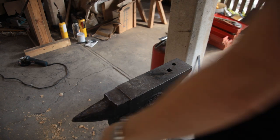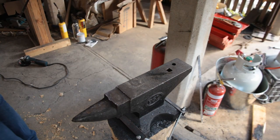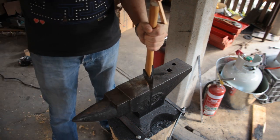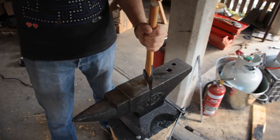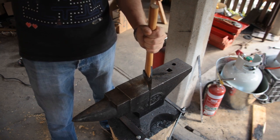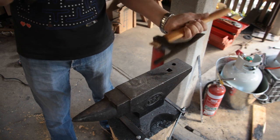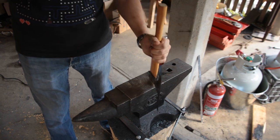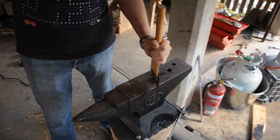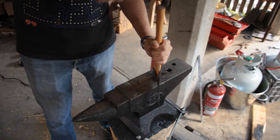So, if you're fitting a wedge, it's easiest to get it to go all the way in without breaking the wedge or splitting the wedge if you work down onto a hard surface. Striking this way also, using inertia, draws the hammerhead, axe head, whatever you happen to be hanging onto a handle, further onto the handle, so you get a tighter fit.